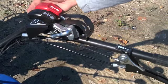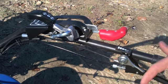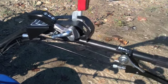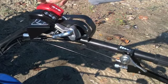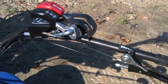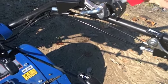These two levers here — this one is for forward and reverse. When we pull this back, that makes the machine run backwards. The PTO will not engage when the machine is running backwards, so if you accidentally let go and it starts running toward you before the kill switch stops it, it's not going to take your feet into the tiller. There's a safety on that — you have to pull back, come to the side, pull back some more, come to the side again, and then engage it in reverse. Also, when you pull back into reverse, it's going to be disengaging the PTO, and you can see the PTO lever will move back as I engage it into reverse.